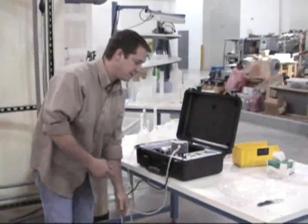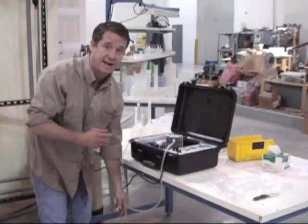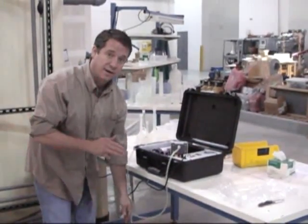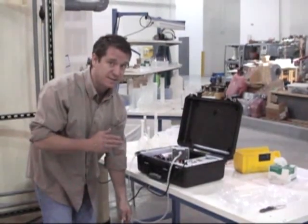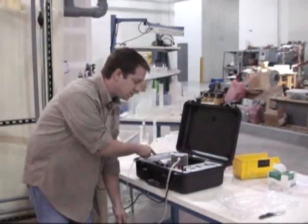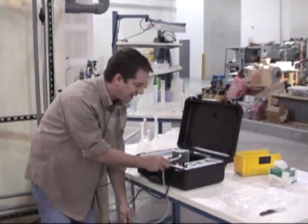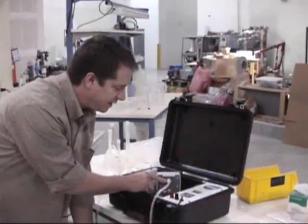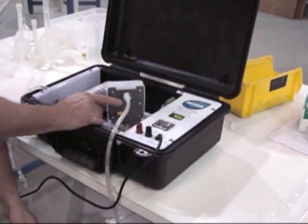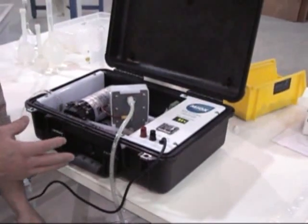The system is designed with a printed circuit board behind this white panel that has a self-resetting circuit breaker. It will trip out when the system gets greater than 15 amps. The pump will continue to run, so you will see solution continue through the cell. If you look closely at the tube, you will see it gets cloudy as it comes out — that is part of the electrolytic process, and some of what you see is actually hydrogen coming out.